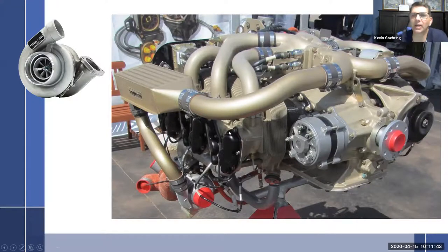Once you blow the coupling off, you have a gigantic induction leak — the turbo no longer blows into the engine; it becomes a naturally aspirated engine at best. If the leak is past the fuel control unit and throttle body, you've lost everything — you have a massive induction leak, all cylinders pull air from the wrong side, and the engine won't run. I shouldn't overstate it — I never had a problem with them, I just hated them. They're difficult to install correctly, but if you pay attention they're fine.